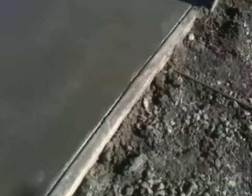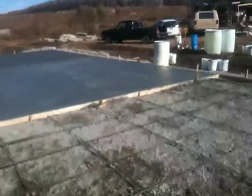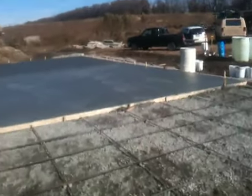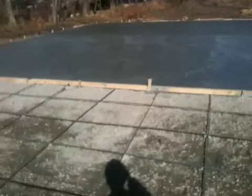We've got a 4-inch slab, with rebar on the bottom tied together every other square on about two-foot centers. Today we're going to mark out column locations, and tomorrow lay the first bricks with a team of 25 people. We'll see how this changes by tomorrow.